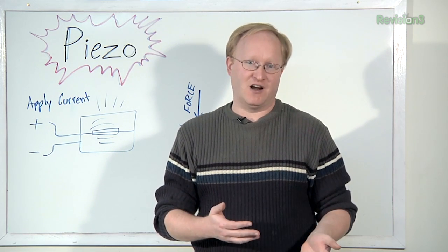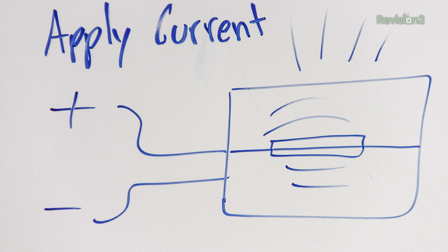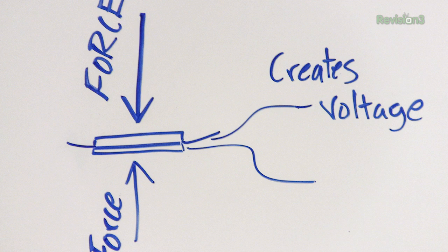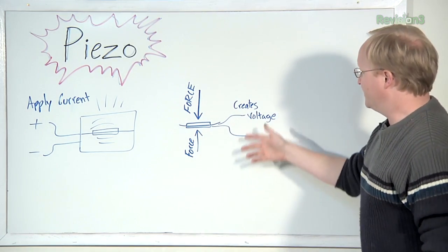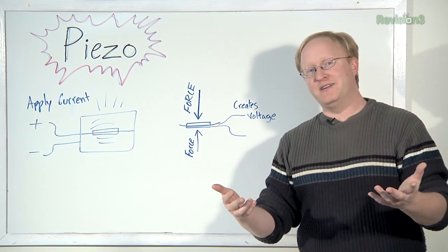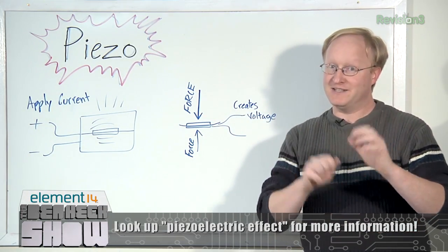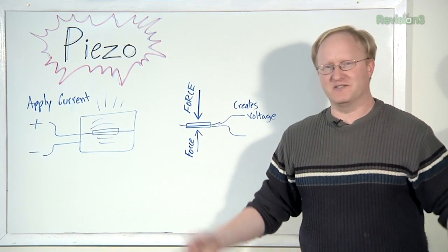Now it's time for a tech timeout. We're using piezo buzzers in this project to set off the alarm. Piezos are kind of cool — you can use them in different ways. A piezo buzzer applies voltage to a piezo inside a chamber; the chamber causes air to resonate when the piezo vibrates, creating sound. You can also use piezos to detect force: applying force deforms the piezo, creating a small detectable voltage. You may have encountered this without knowing it — like the Rock Band drum set, where hitting the pads deforms piezos to sense a drum hit.